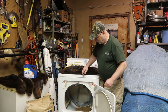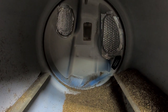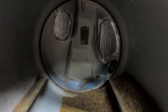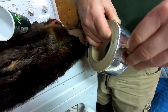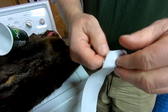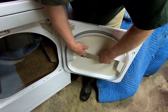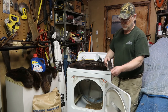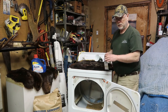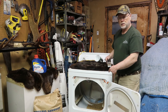Inside the drum you have to close off any vents. You seal the inside of the drum — there were holes in the back where air used to pass — and you close them off with aluminum duct tape. This stuff has a one-sided tape, aluminum on one side. You just cut off the pieces you need, rip off the backing, and apply it wherever you need it. It goes on pretty solid and never really comes off. Seal up any holes so it becomes a closed drum, because you don't want sawdust getting inside.